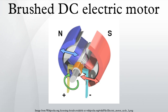Manual starting rheostat. When electrical and DC motor technology was first developed, much of the equipment was constantly tended by an operator trained in the management of motor systems. The very first motor management systems were almost completely manual, with an attendant starting and stopping the motors, cleaning the equipment, repairing any mechanical failures, and so forth. The first DC motor starters were also completely manual, as shown in this image. Normally it took the operator about 10 seconds to slowly advance the rheostat across the contacts to gradually increase input power up to operating speed.